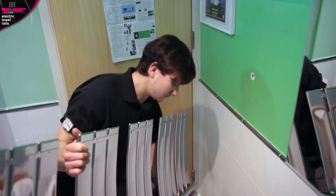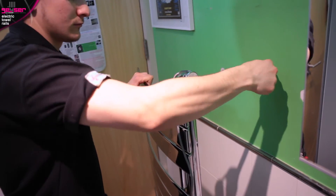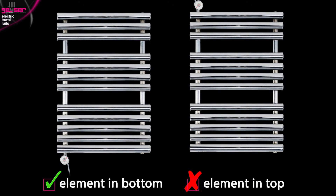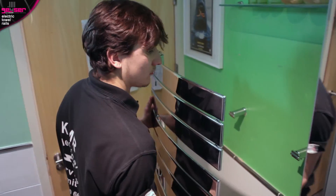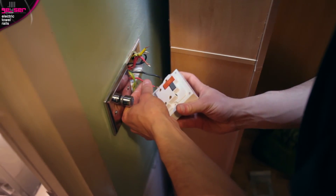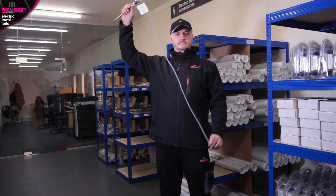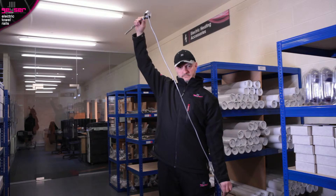The electrician will turn the rail upside down and remove the left or right underside blank plug and insert the heating element into the bottom of the rail. Note: elements cannot be installed into the top as they will not function correctly — heat rises, therefore the elements have to go at the bottom. GIZER supply all elements pre-fitted with PTFE tape, which helps ensure a watertight seal. The rail can now be fitted to the wall and connected to the electric supply. Remember, switches cannot be located in UK bathrooms, so your fuse spur, timer or combination device will need to be located outside the bathroom. Single heat elements are supplied with a 1.2 metre length cable, and variable heat rails with a slightly longer 1.5 metre length cable.